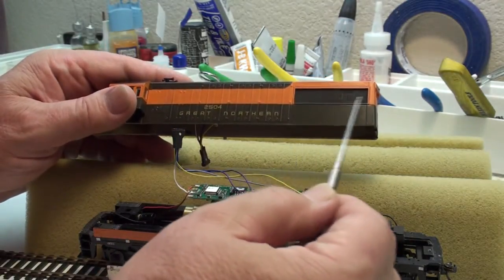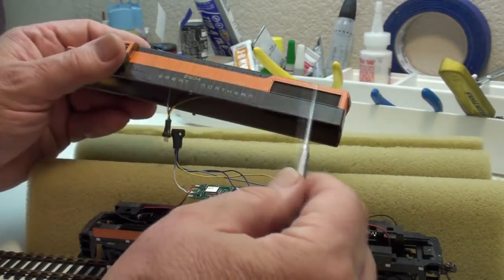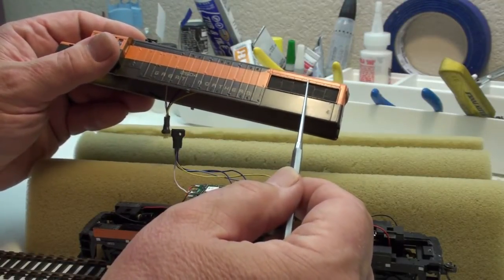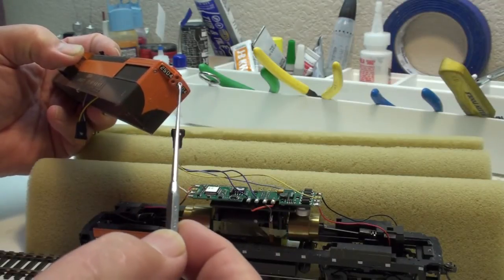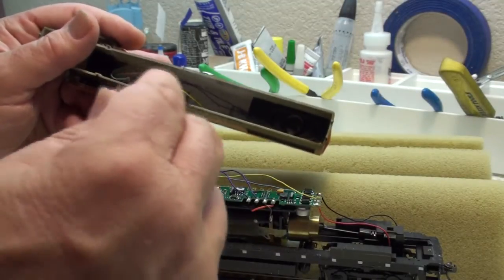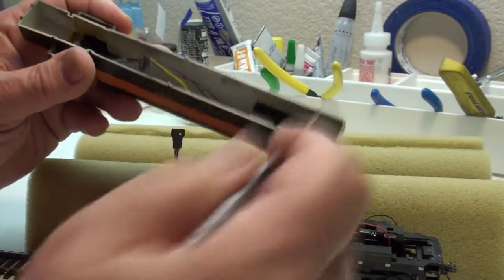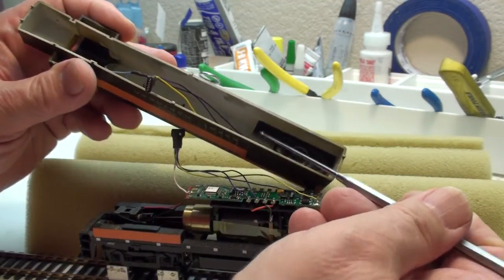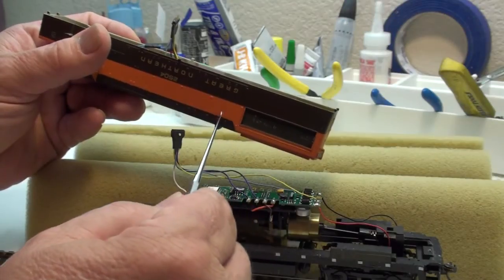The issue with this locomotive is there were large open fan grills back here and here, and the top wasn't open, but how to get the sound out of this required a little bit of thought and a little bit of work to get there. The first thing I did was I installed an LED to light up the rear lights and hooked it up with blue and yellow wires coming out here. Then I mounted a speaker, a 20x40mm speaker — had to sand the sides of it down just a touch to get it to fit right in here. It's kind of difficult to see because it's all black, but this is a piece of black plastic and this is a piece of black plastic that seal that speaker off in this area right along here, right down here.